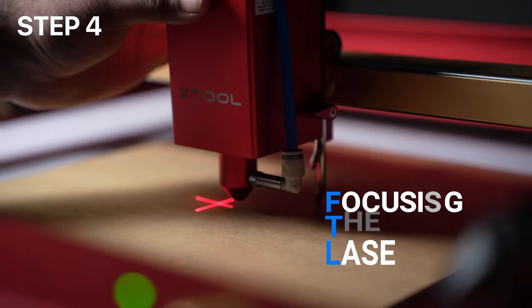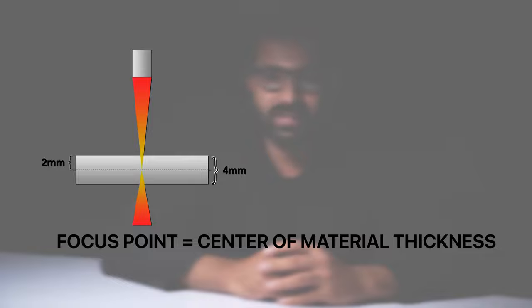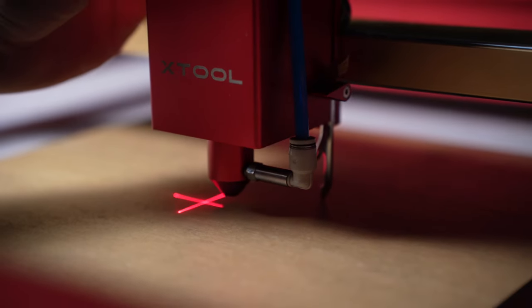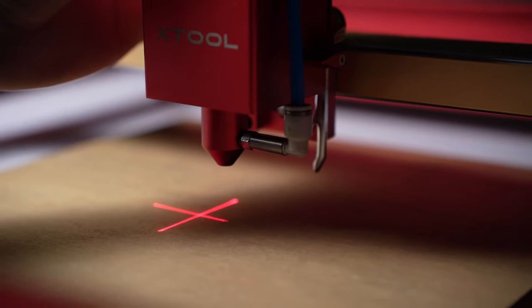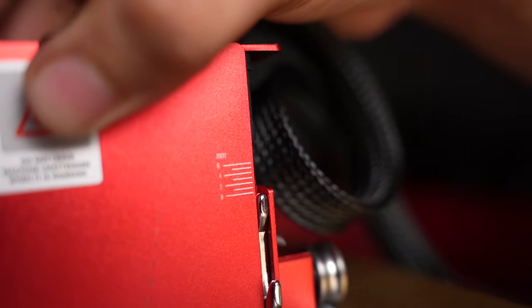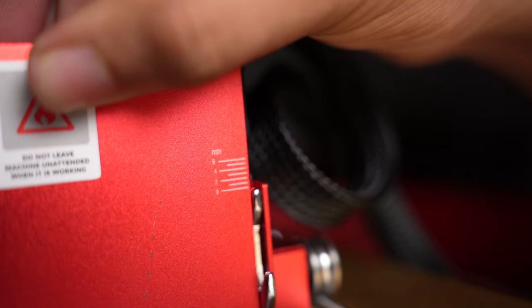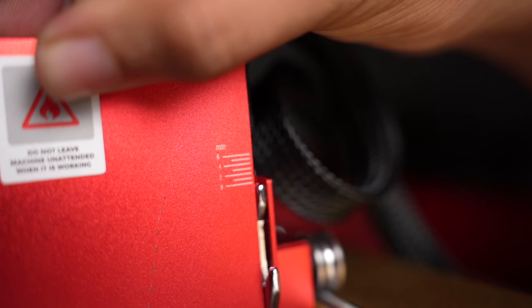The next step is knowing how to properly focus your laser for cutting acrylic. You should try to focus the laser at the middle of your workpiece. For example, if you want to cut 2 mm thick acrylic, you should set the focus 1 mm lower than you usually would for engraving. If your laser requires a 5 mm gap between the surface and the module, for cutting a 4 mm thick sheet you should set the gap to 3 mm. On my Xtool D1 Pro, there is a feature that lets you compensate for material thickness — if my material is 4 mm, I align the focus bar with line 2, for 6 mm with line 3, and so on, then focus the laser as usual.